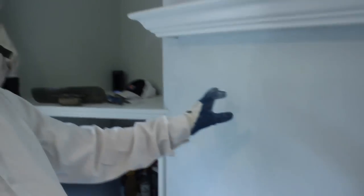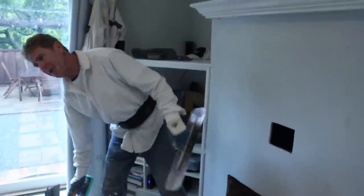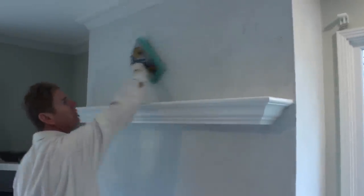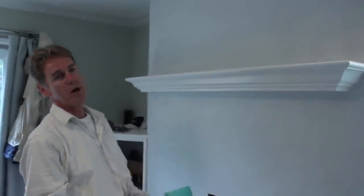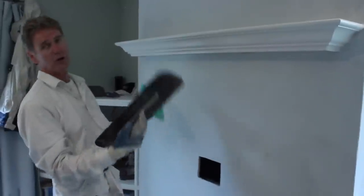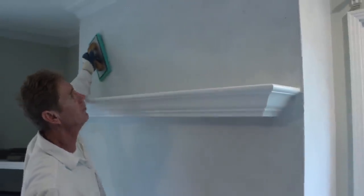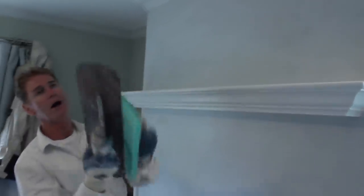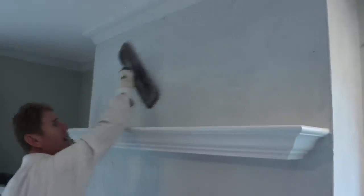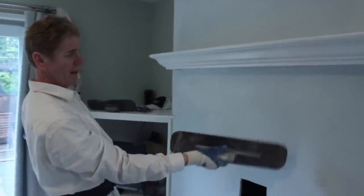Can you get a close-up of the spider checking? That spider checking occurred right here as it's drying and in a few other places. Right now I would call this a level two or level three finish. What's level one through five? Level one is just one coat of tape and mud. Level two is covering all your corners and tape. Three still looks like crap. Four, you've got to do two coats. Five is what I'm about to show you. You've got to wet the wall if you're going to try to do what I'm doing — this takes a lot of years to learn. You wet the wall, you wet your trowel, then you just trowel it, and that gives it a high gloss sheen that looks like glass.